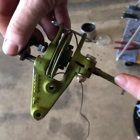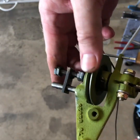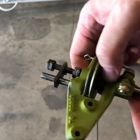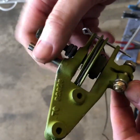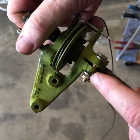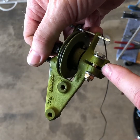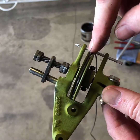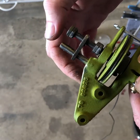I have put the cable in with the square end into that shaft and then tightened — the lighting is terrible — tightened these two screws. Remember they go through the shaft and they lock the speedometer cable in. So those two screws are tight holding the cable, and then this bolt and this clamp is actually holding the outer case of that cable. Then I put the cotter pin in — I haven't bent the tabs yet. This holds that side of the cable from coming out of the pulley, and the housing holds the other side of the cable from coming out of the pulley.